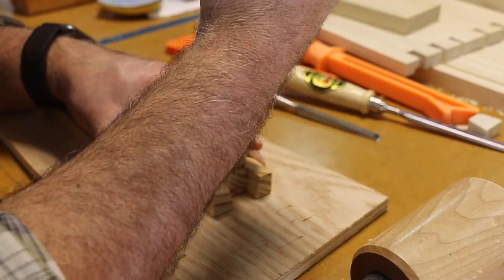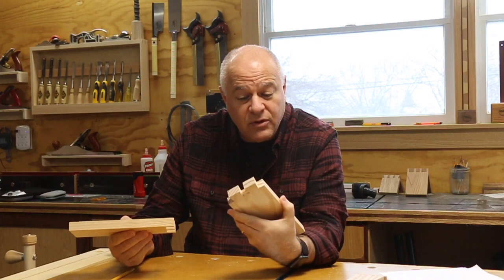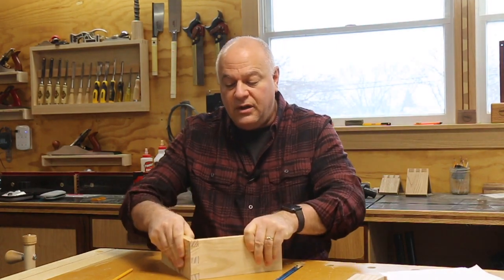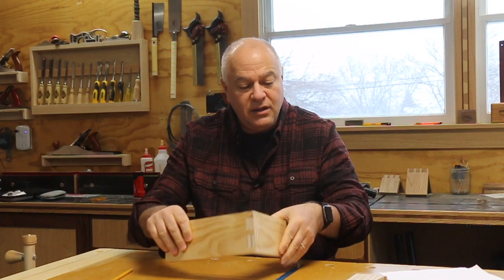As you can see, I'm continuing to clean up the little bit of waste that's left with the chisel. Then it's some final tuning and a final fit. So that's the basics of cutting it using the bandsaw and then doing some of it by hand. As you can see, it does help get a really nice joint. It was a little bit faster for me to do it this way, just because I didn't have to spend all the time cleaning up the tails, and they were perfect.